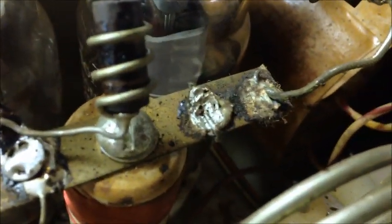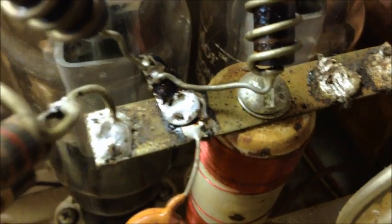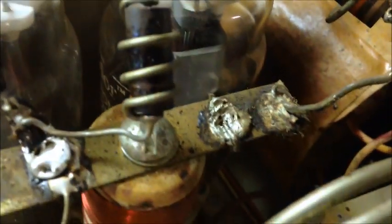And then on top of it, I don't know what kind of soldering iron they had — it doesn't look real healthy for the soldering on the bar up here at the top off the choke. So we're going to just dress that up. I mean it's making contact, they're all solid, it just doesn't look pretty.